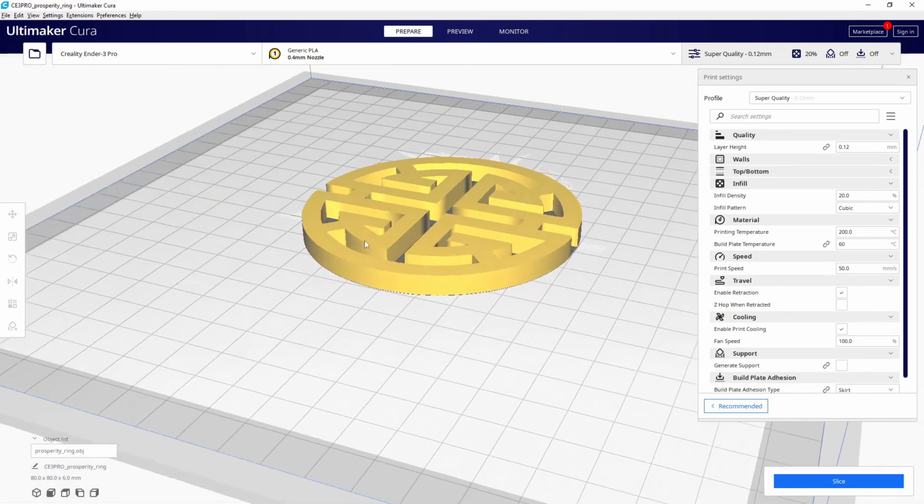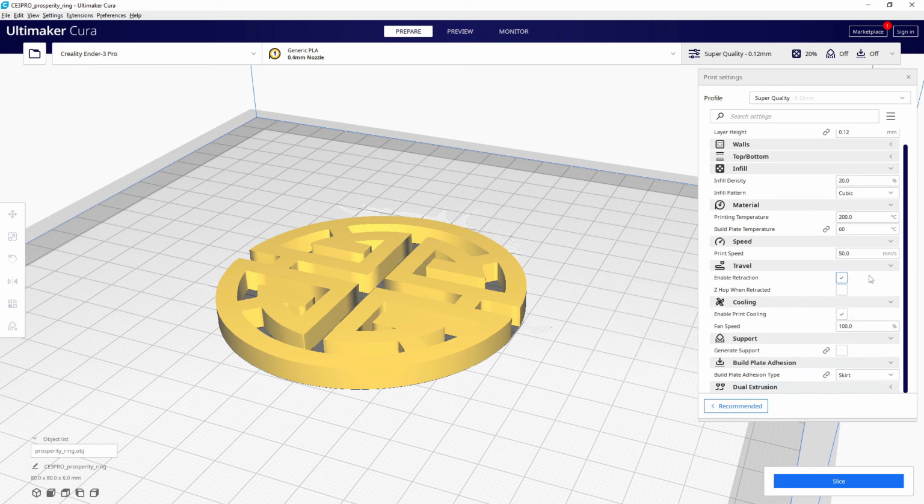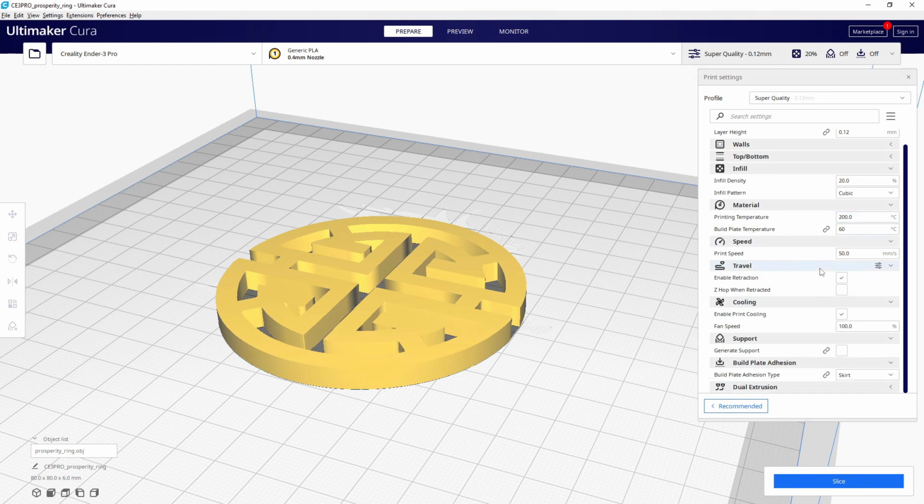Parts can be solid or printed with various densities and infill patterns. If the part is detailed or delicate, print speed can be slowed down to ensure there is no bounce, wiggle, whiplash, or vibration from the printhead being moved about on the gantry. Once the desired settings are entered, the part can be sliced. We receive a very accurate estimation of how long it will take to print and how much plastic will be used in both grams and meters.